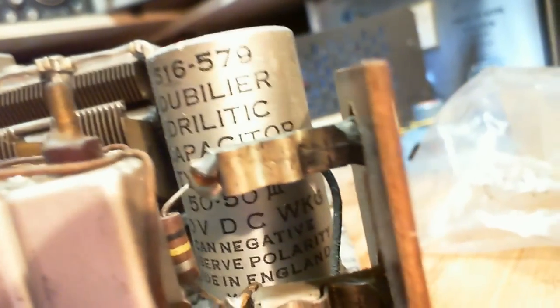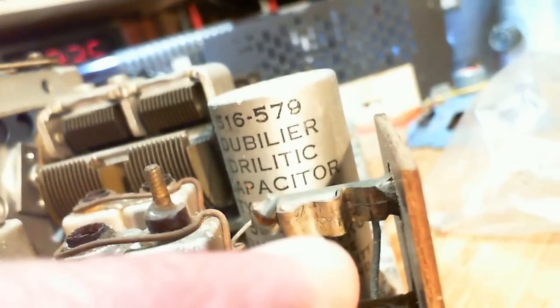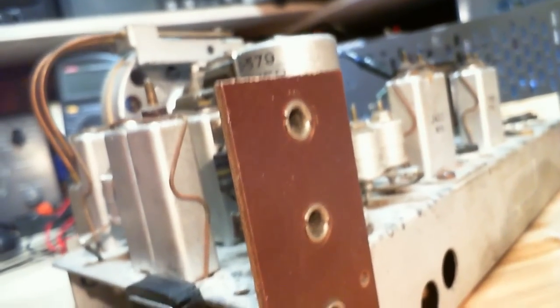This one looks like this lower pin is just resistored from the upper pin. And the upper pin has a lead going off down into the radio. So I'm guessing if you get too strong of an antenna, you stick it into this one. And if the antenna's short or weak, you stick it in this one. And in the course of operating the radio, you probably just try both spots. I think what they're trying to avoid here is making the radio really sensitive and then having somebody connect a whopper antenna to it, presenting the radio with strong signals and lots of noise and stuff like that.